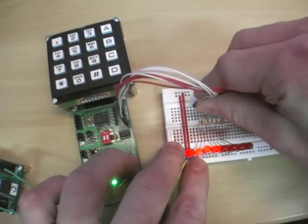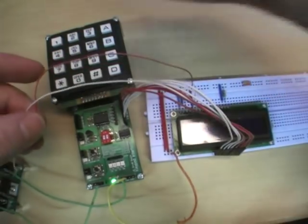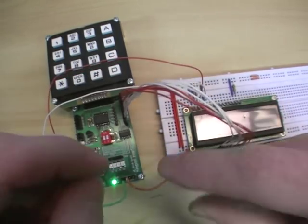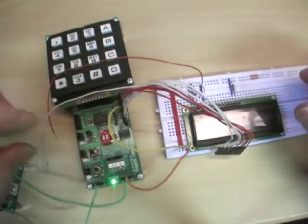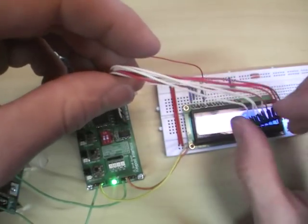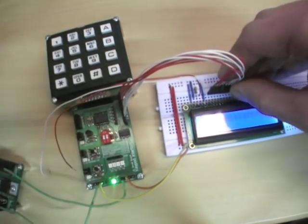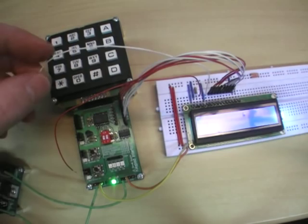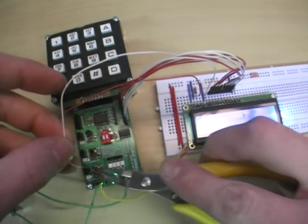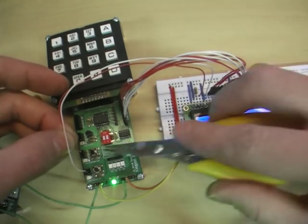This is handy for applications that use an 8-bit number — for example, an LCD. Simply plug our 8-bit number onto the data lines. Pin 6 of the LCD is Enable, which goes into our Momentary On output. Pin 4 is Register Select, which goes into the Push On, Push Off output.